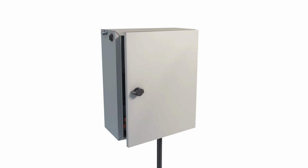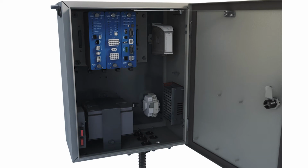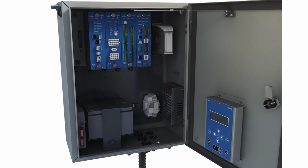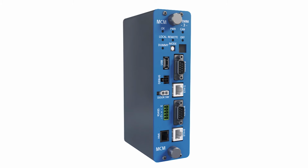The Gemini RTU has a modular design such that it can be configured from a very simple monitoring device through to a sophisticated multi-switch control unit with high input count of analog and digital signals, as well as secure switchgear control outputs. The Master Control Module, or MCM, contains the main processor for the RTU. It supervises all modules and handles the protocol communications. All configurations of the RTU must have an MCM fitted.